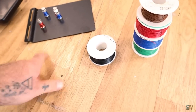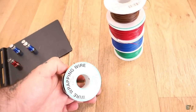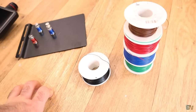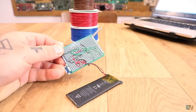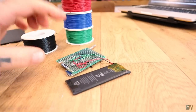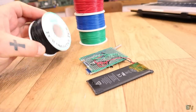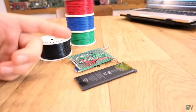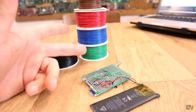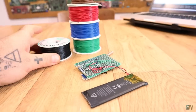For example, if you're using Arduino and you want a 5 volt connection across 3 meters, the signal may not arrive with full voltage — causing noise and errors. But for very short connections, like in this radio transmitter project, it's perfect because the wire is very thin, easy to solder, and very cheap. For about $7 you get 300 meters of this wire in many colors: red for VCC, black for ground, green or blue for signals. I'd say it's suitable up to about 1 meter.